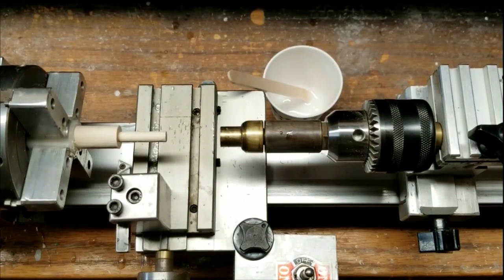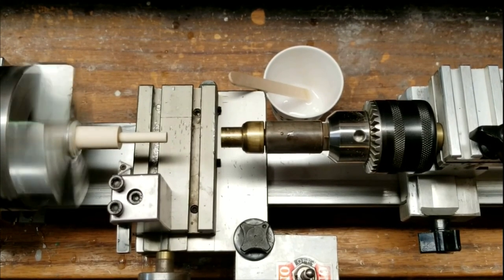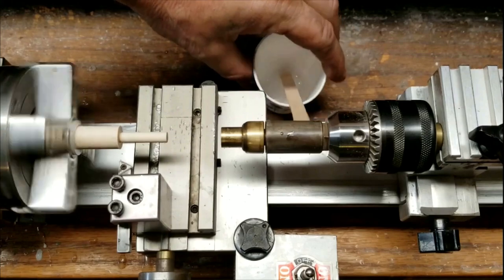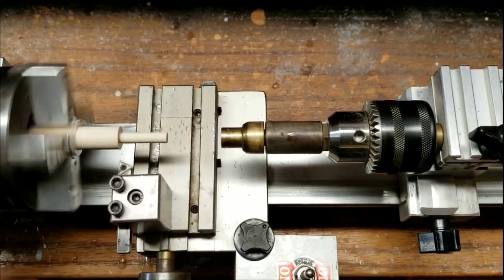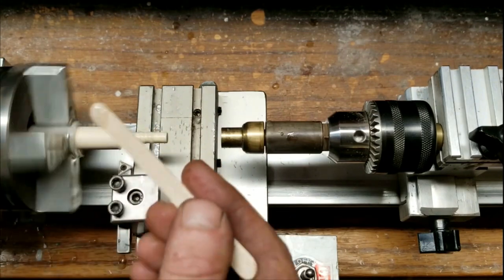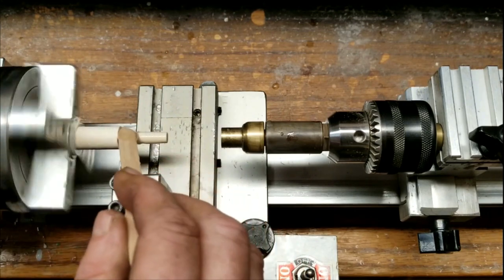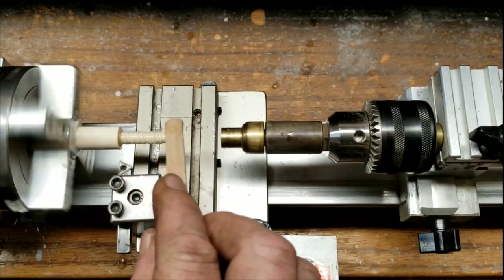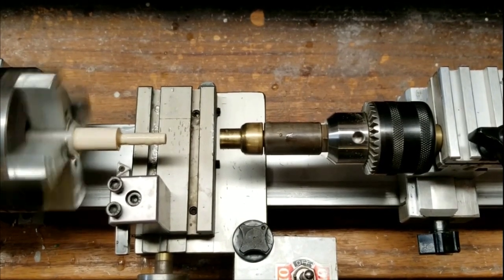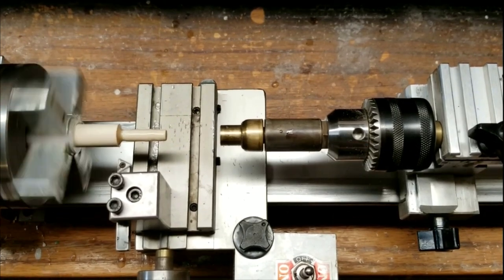I will turn the lathe back on and slow it down and turn it in reverse. Now apply the epoxy. When applying the epoxy, I always start from the shoulder and work my way out. And I'll do 3 coats, and I'm putting pressure on this. I'm pushing it into this tenon. There you go. And that's all you need there. Let that sit for just a second so it can balance out. Once it balances out, you can put the ferrule on.